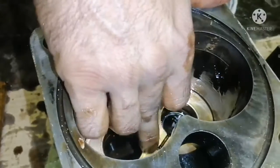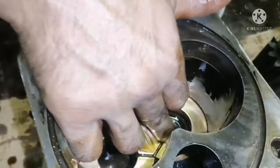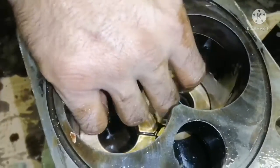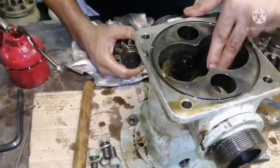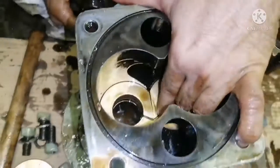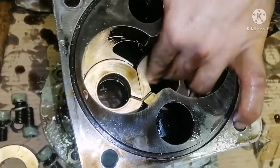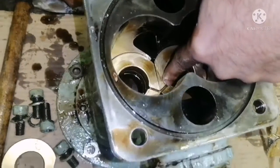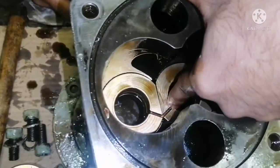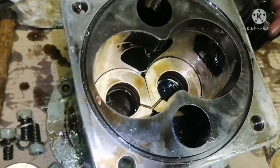You can see the bushing arrangement should be like this — when oil comes in, oil pressure will be created and it gives way to the suction of your pump. This is your drive-in shaft. This bushing arrangement is actually the way recommended by the maker: fit the suction side bush in this way so that oil coming from the suction side will get pressure created through this groove, and this will support your gears to take suction and deliver it to the discharge side.